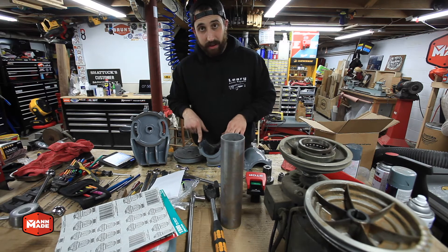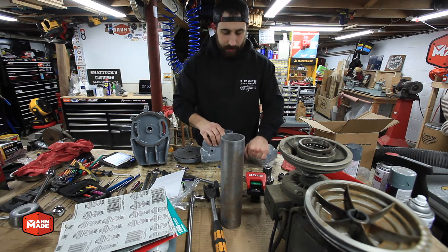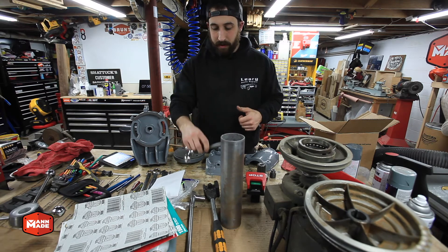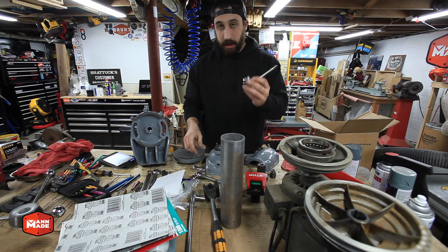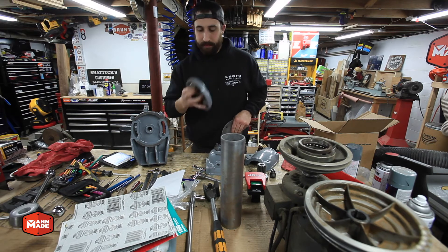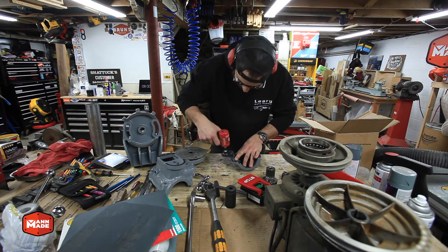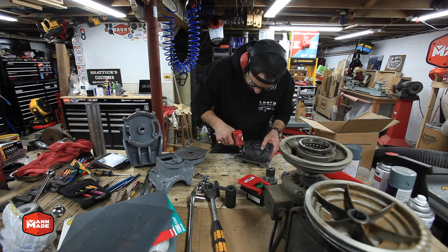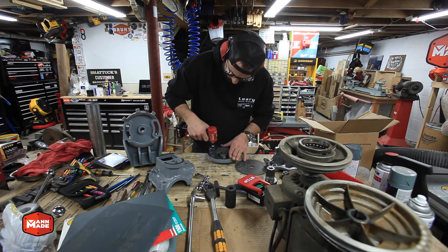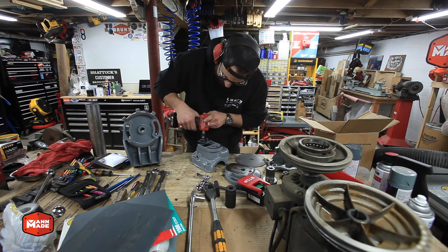Now I'm going to clean these machined edges. I've got the rear column cover, the front half of the gear case, two main gears, the shaft spindle and crank, the cam lock for the column lock, the interface plate, and pivot plate. I used my die grinder and a Scotch-Brite wheel to prepare the surfaces that will mate together — they don't seal, so it's not mandatory, but I like a good clean polished surface before any waxing or assembly.